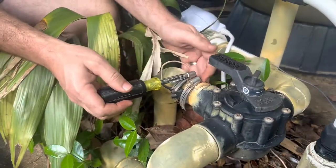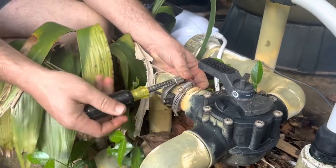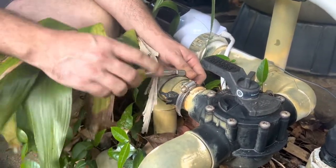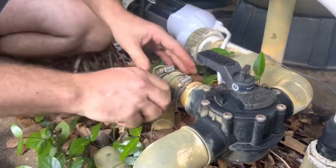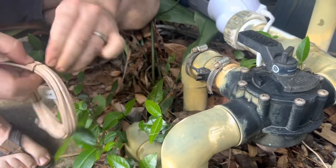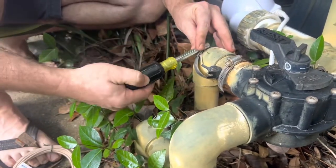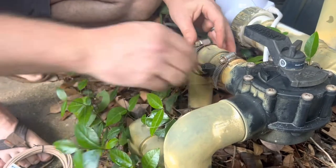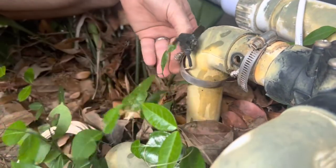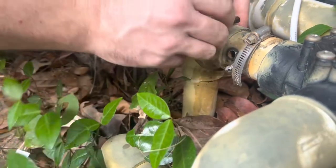We're going to loosen the clamp that is currently in place. This one's already been replaced once and they actually glued a piece of PVC over the previous hole — it was probably a different size component, but this one looks like an exact replacement so we shouldn't have to do that. You can probably reuse this clamp if you'd like to. Now that we've got that loosened we're going to pull it out — a little water is already dripping because we've released the tension. We're going to pull this one out and remove the clamp more to get the old one off.